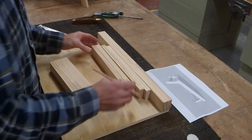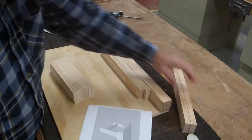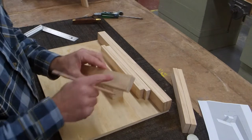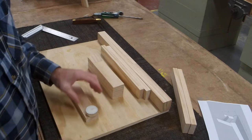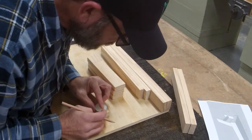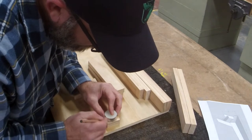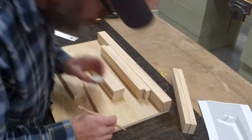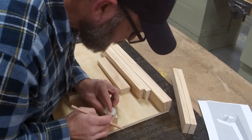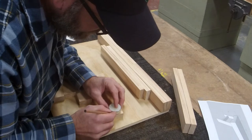Let's go chop that up. Now the marking out — these are the two supports for our legs, so for now I don't need to do anything with them. Our four legs — that's my 15 degree angle. I need to curve this. Ideally find something that's nice and round, the same width. Be real fussy, nice and accurate — sharp pencil. We're going to nick these off on the band saw and then we'll use our linisher to round these nicely. Remember, anything to do with curves — your fingers and hands should love it, should be nice to touch.